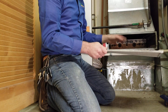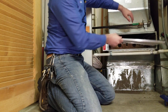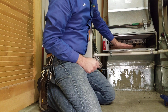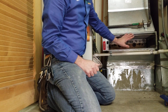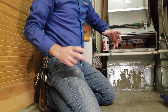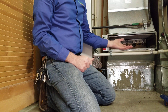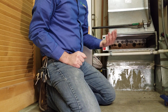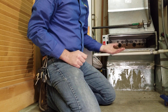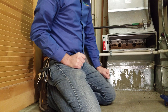After I wash these, I'm going to install them correctly — up here, after the filter cell. We'll also need to order and install some pre-filters. Another option you can use is a pleated filter — in this case a 20 by 25 by 4 or 20 by 25 by 5 air filter, rated anywhere from MERV 10, MERV 11, MERV 13, up to MERV 16. MERV 16 will be the best, and they cost anywhere from about $35 up to about $100 depending on the efficiency level.